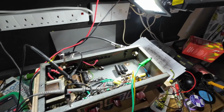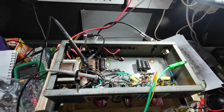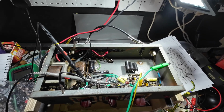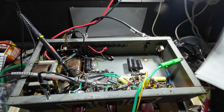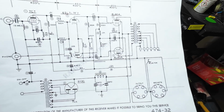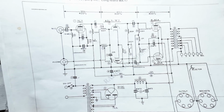So now to balance up the phase inverter, we'll worry about that 7F7 later. So I've got a 1K resistor jumpered in now, which is what's on the schematic. And if we hone in on the schematic here, it's a bit bright, let's go there. If you look at the cathodes on the 7F7, the tied, with a 1k resistor there. Look, it says 22. That's going to ground.